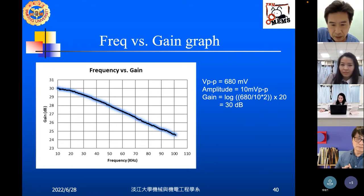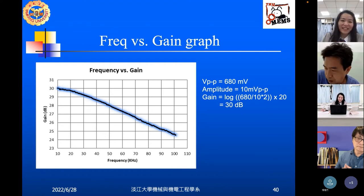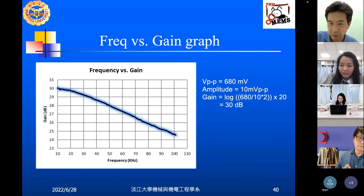Do you have the number at hand? What I observe is that earlier the flow sensor alone could measure only 138 microvolt as the sensitivity. After including the instrumentation amplifier, due to the improvement of the signal to noise ratio, the sensitivity was improved 10 times. But I do not have the value of the SNR. Yes, you might have to measure the noise floor so that you can report the signal to noise ratio, but I know it's troublesome after your defense. So it's better to leave it to Professor Yang's judgment whether you should provide this number or not.